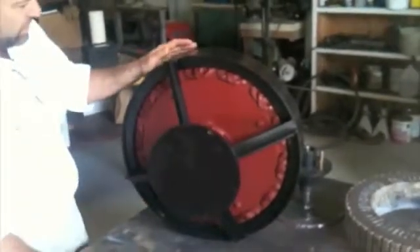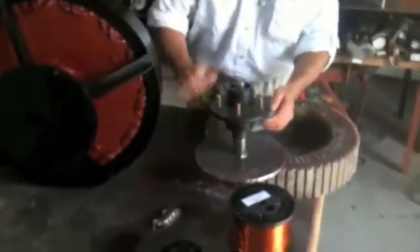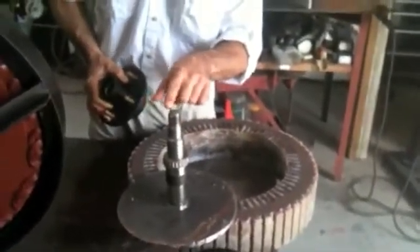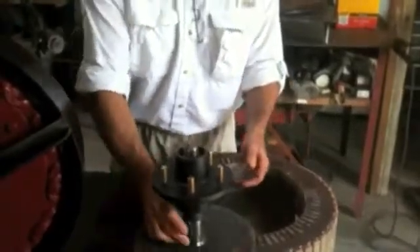It's a heavy duty system. We start with a 3500 pound axle and heavy duty bearings. It has a Zerk grease fitting where you can maintain it. You may, once a year, tighten the bolt a little bit and squirt a little grease in it to keep it up.